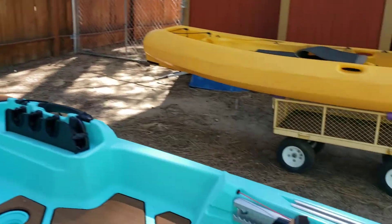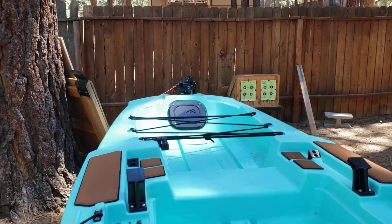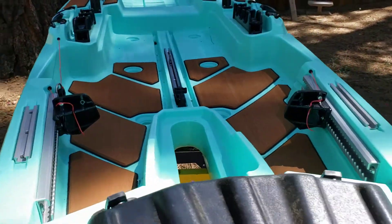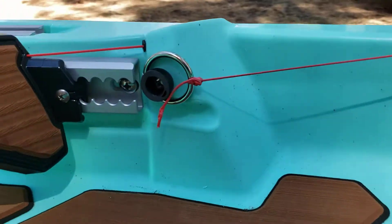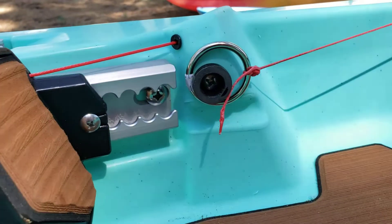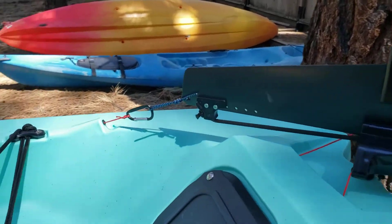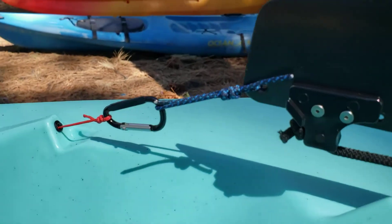To stow the rudder we need to steer it all the way to one side. There we have it — we've steered it to that side, then we grab hold here and pull that up. It hooks right there. That is a tarp toggle — I removed the ball, shaved it down a bit to make it kind of a button, then put it in there with a stainless steel quarter-twenty screw and nut. Back here you can see how the hoist works — there's a little loop of utility cord to reduce friction in the system.